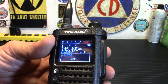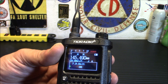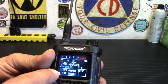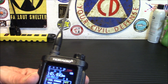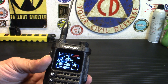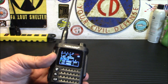To explain item seven — dual watch: when one side is transmitting, let's say my 440 side is transmitting, I will hear it. But if I'm transmitting on two meters, of course I won't. If they're both active, whichever one started first you'll hear. It's nice to have that so you can keep an eye on a second frequency. At events here in town we've used two different frequencies — maybe a local chatter frequency on the course and then a main repeater frequency like for Baker to Vegas. Very handy to have.